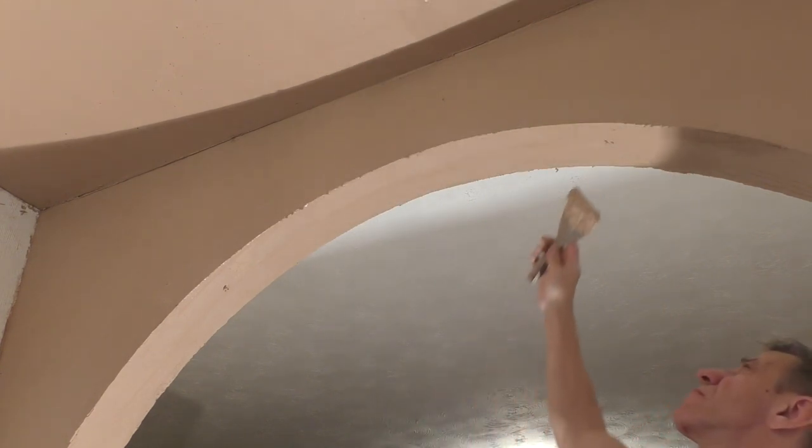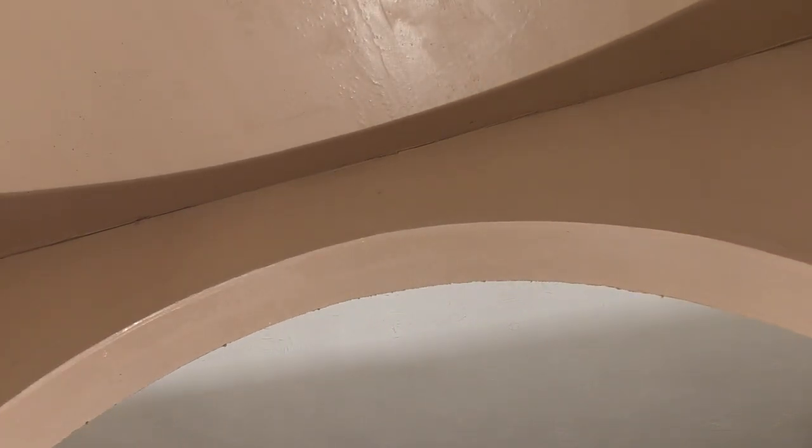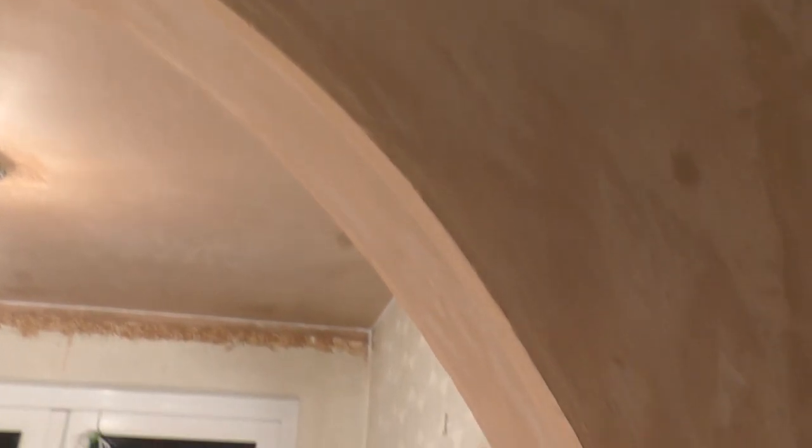We're coming near the end. Like most plastering it's thinking about what to do - here the pinched index finger and thumb is a technique I'm using. I've got water on that edge, with my thumb and index finger pinched together, dragging around the edge. It still looks quite rough there, but as this starts to dry and you continue with the troweling and taking your finger and thumb around that edge as it dries out, you'll hopefully end up with something similar to this. If it's bitty anywhere, you can just take sandpaper over it when properly dry, or tell the client it will need a very fine sandpaper gently taken around that edge before their mist coat and painting.